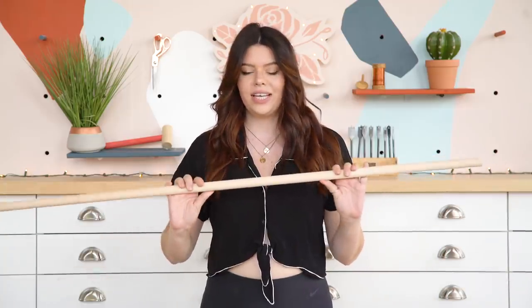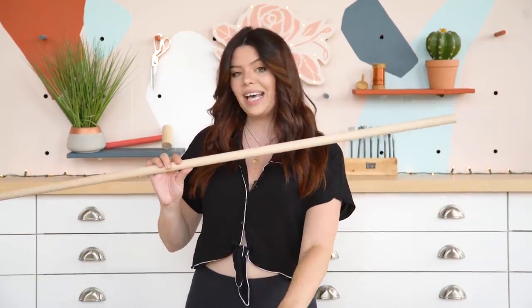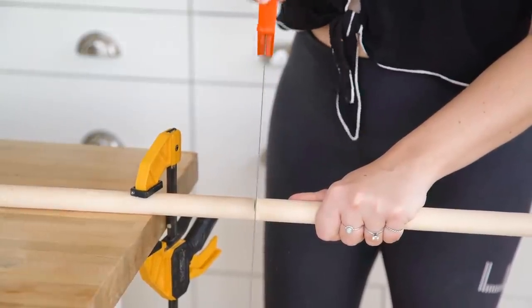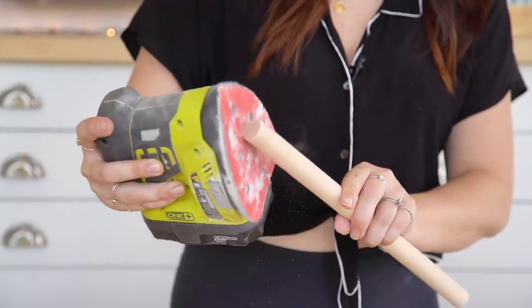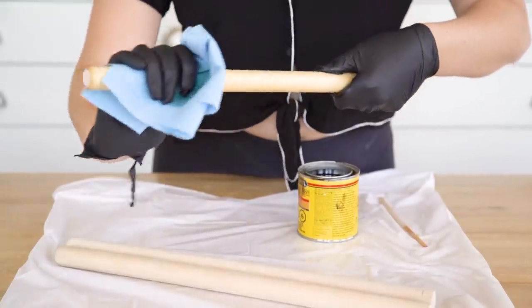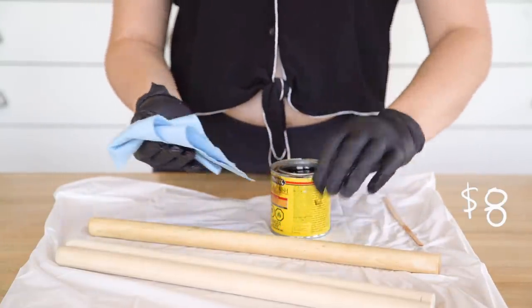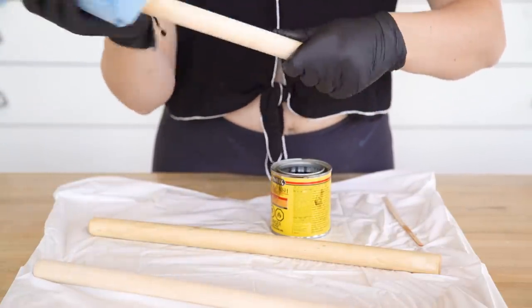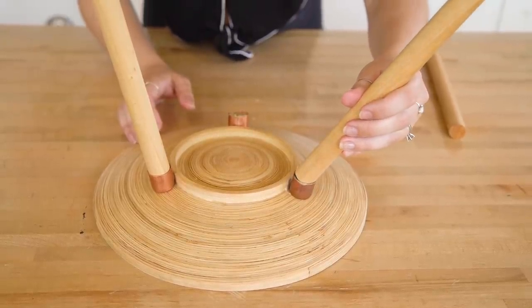Now that my copper caps are completely dried and secure onto my plate, it's time to move on to the legs. I'm going to use a wooden dowel — a four-foot one that only cost me $4 — to make all three legs. I conveniently picked a dowel that fits perfectly inside my caps so it's nice and snug. I'll divide the whole dowel by three, cut it to that length, and have three legs. I used a handsaw to cut the dowel into three parts, then sanded one end flat and rounded the other end to look more polished. The color of the dowel was close but a little off, so I stained it a honey golden color — that adds $8 worth of stain to the project, but you could skip it. They look beautiful stained.